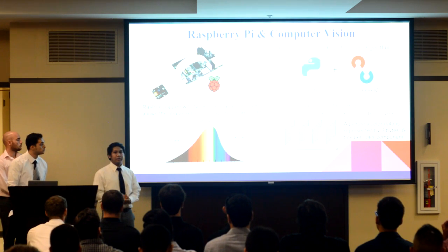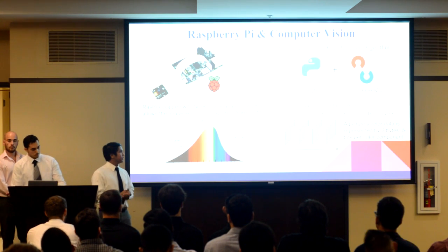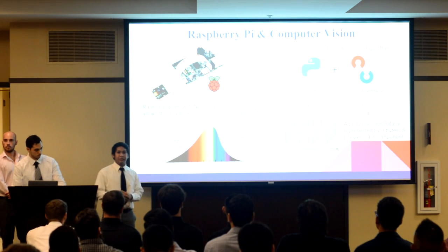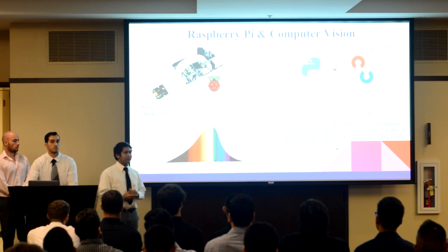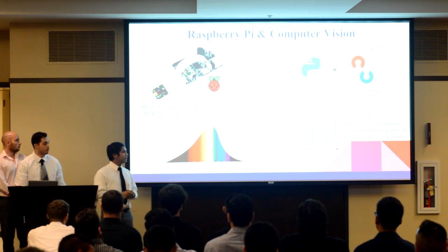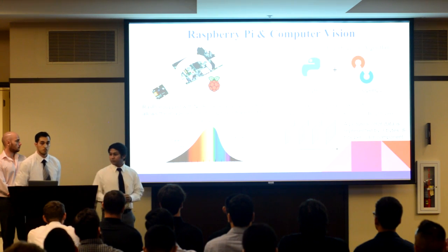The core elements of our fire detection system involve the Python language and OpenCV. OpenCV is the computer vision library that we implemented because it allowed us to perform the various video and image processing functions that we needed for flame detection. Of course, flame detection, image processing, video processing is very computationally heavy on the Raspberry Pi's CPU. Therefore, we had to optimize and simplify our data workflow.